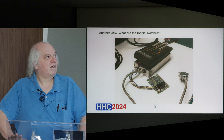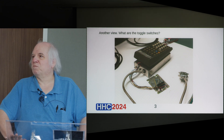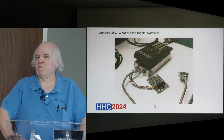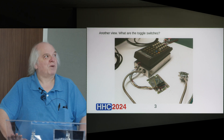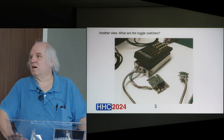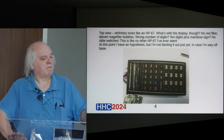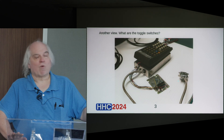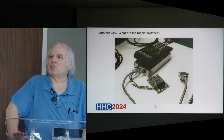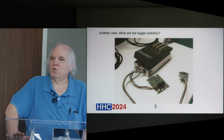Is that where power comes in, and did you power it up? It has not been powered up. I don't have any information on the pinouts, so short of doing more reverse engineering, I wouldn't even know where to apply power or what voltage to apply. If I find myself at loose ends I may investigate it further, but also powering it up — it wouldn't do anything because I don't have anything aside from power to connect to that. It would not serve any function to power it without having something that provided the ROM emulation capability wired up to it. Even if that Spice chip has the 1K of internal ROM, that 1K of ROM never contained enough code to do anything useful on its own — it wouldn't even generate a display.